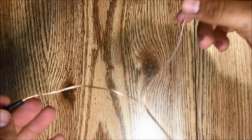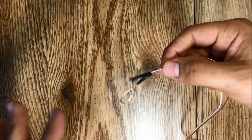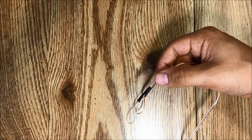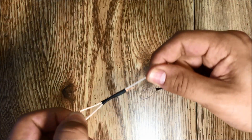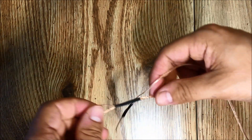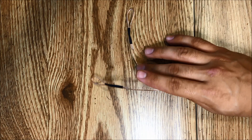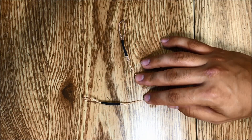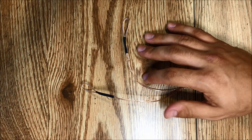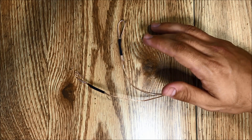Okay, so here are the ends. I haven't split this all the way apart yet since I'm still in my apartment — it'd be a pain. I looped them back. I did cut this slightly longer, but the length's not too specific in this case — a little longer is probably better than a little shorter. Looped it around, used some heat shrink. It seems fairly strong. It's not a permanent antenna, it's temporary. Basically now the antenna's done. The whole thing is 100 feet of cable. I used 33 feet for each leg of the doublet, so that leaves about 67 feet of wire — and that's your feed line.